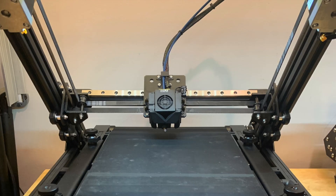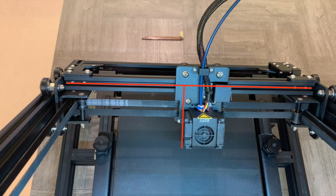What is it about the stock setup that makes this so important? Unlike traditional 3D printers, the hot end is cantilevered off the X-axis at 45 degrees. This leads to torsional forces unique to this printer. The wheels are very close together on a narrower rail, meaning they are unable to meaningfully handle these forces.